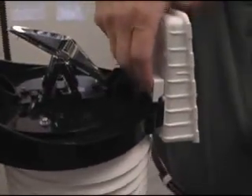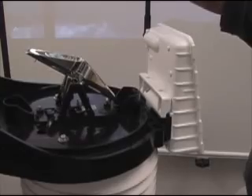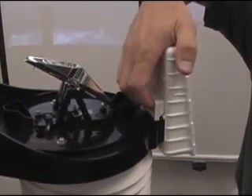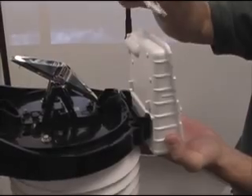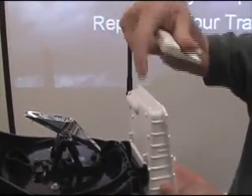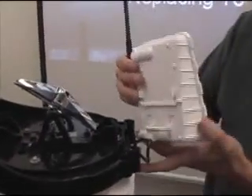On the back side of the shelter is this locking tab. The easiest way to do it, once you have the rain collector cone off and you'll get more room that way, is to put the palm of your hand on top of the shelter, curl your fingers under the edge of the top of the tab, and just pull. It'll make a popping sound — it's a little tight but you're not going to break anything. You're basically pulling out these little locking triangles that are down in the insert. Once you have that, the shelter comes off.